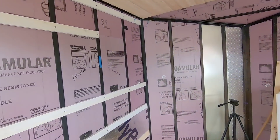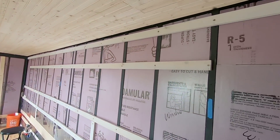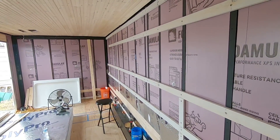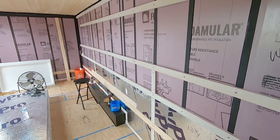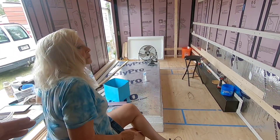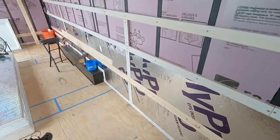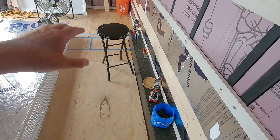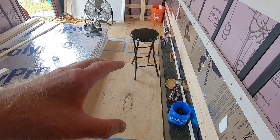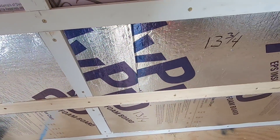Let's show them where we're at right now. We've been working on the second layer of insulation on this wall and we are not done — this ain't our first rodeo. We're putting furring strips approximately where we know we're going to be attaching things. This wall is going to have plumbing on it because the kitchen sink will be somewhere in this ballpark right in here, and the bed frame is going to be right in here. The water heater will be somewhere in this area.